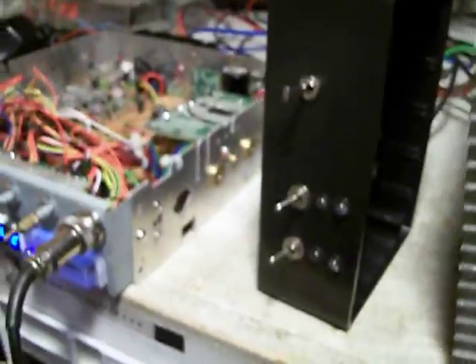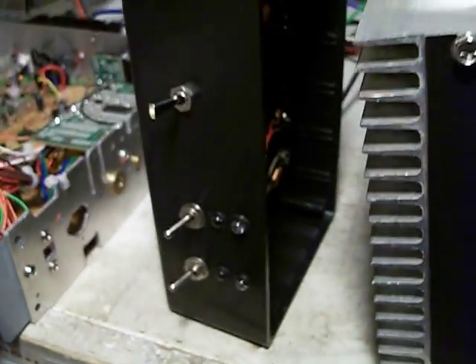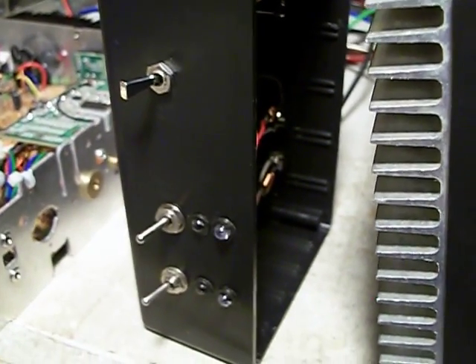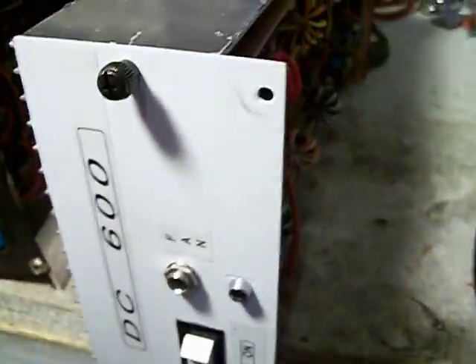The radio I'm using here is a Connex — and that's a MOSFET radio. It's really important to make sure that when you run these new systems, you keep everything on the same class and same type of transistor. So the radio is MOSFET, the driver is MOSFET, and the big box is MOSFET.